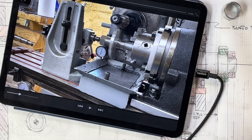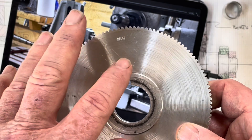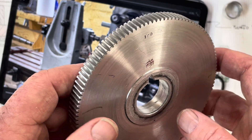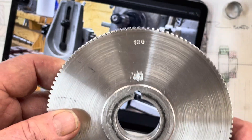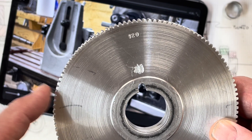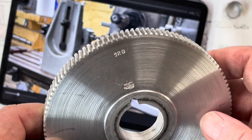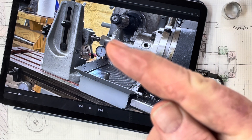Then I drop the table down and move the gear the calculated amount to bring it into alignment with the spindle. It's really not that complicated or difficult to do, but it's one of those things I had to walk myself through the first time. This came out pretty good. I repurposed an old aluminum 90-tooth gear to be a 120-tooth worm gear for the new machine. Aluminum is fine honestly - this gear is only going to go through maybe a hundred full revolutions in its entire life.